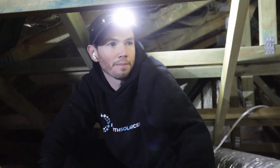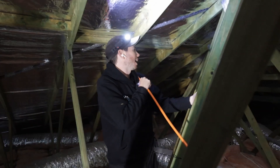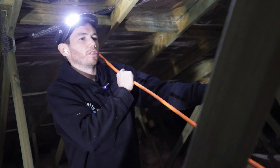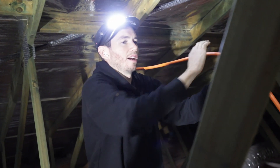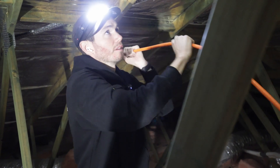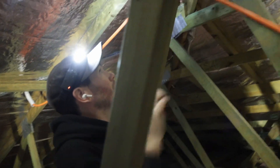You want to put the cable on the other side of that insulation so it's tucked in the eaves. Pull it long enough so it'll go up and over — we want to make sure people can still walk through here, so if we run it straight it'd be in the way. Pull it tight so we can see it's actually going to reach. It's going to be a bit hard to tie because it's quite high up, but we might be climbing up there to do it.